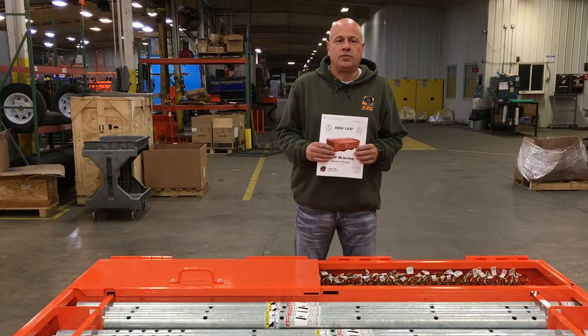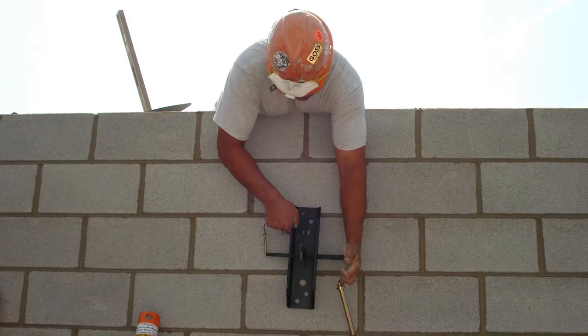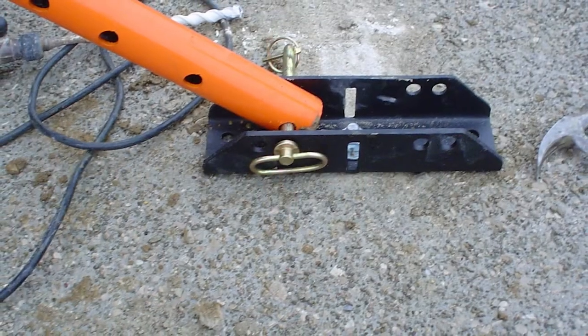When you are two courses above the brace location — or 15 feet 4 inches in this scenario — with a top out wall height of 24 feet and brace height of 14 feet 4 inches, the worker can reach over the wall and install your wall floor brackets by pushing the T-bar to the backer plate, head joint of the block, and the wall floor bracket.